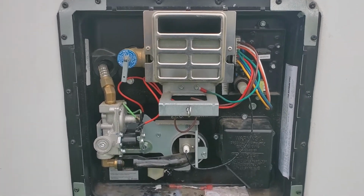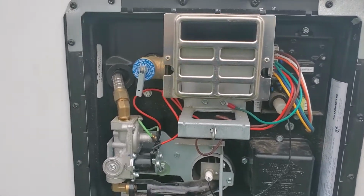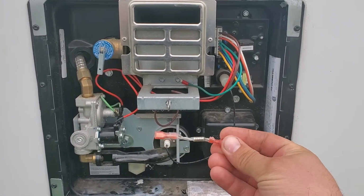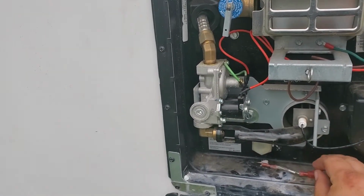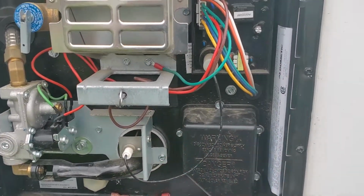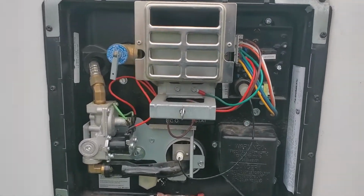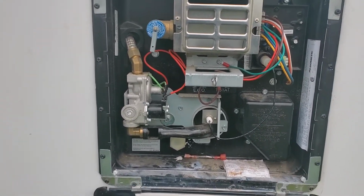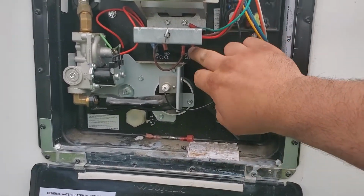It would get the water scalding hot, and then it quit altogether. One time it was like boiling hot, and it had blown this inline thermal fuse, which runs right here to this thermostat. I just hardwired that in so my wife and I could take showers while we were camping with our kids. But I never got it to run right. When the fuse blew, it stopped working altogether. And the problem was still there after I removed the fuse and hardwired it.